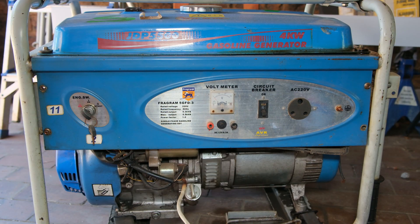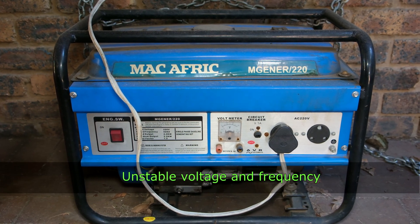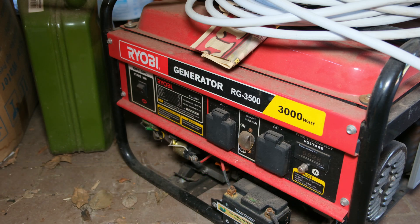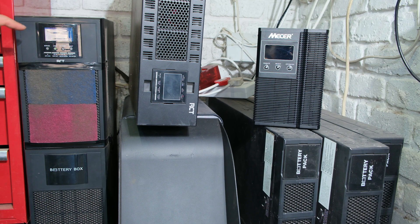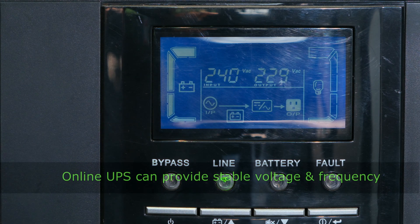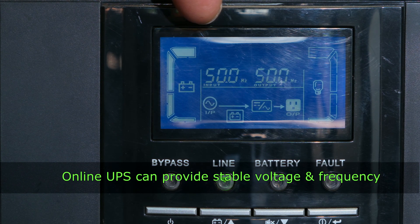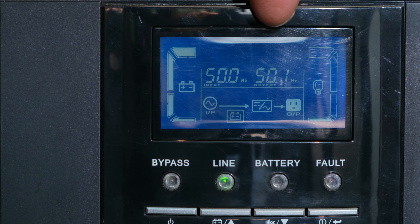I have a common petrol generator here. When it gets loaded - maybe you switch on a kettle - the voltage fluctuates and the frequency drifts. The same problem applies to this other generator type as well. These online UPSs all have something in common: I can lock the frequency. So if I feed my appliances from the generator and the frequency drifts from 50 hertz down to 45 hertz, that's a problem. On this UPS, voltage coming in is 241 volts but the output is 229 - the UPS has lowered it. If feeding from a generator, you'd see frequency drift to 45, 47, 51, 52 hertz, yet on the UPS I can lock it at 50 hertz.